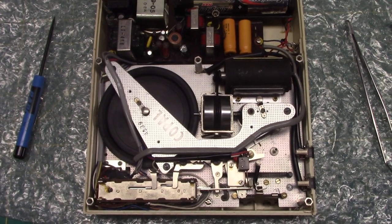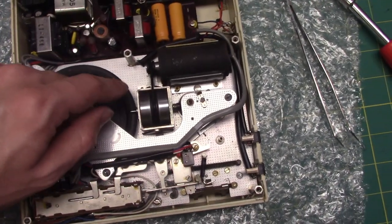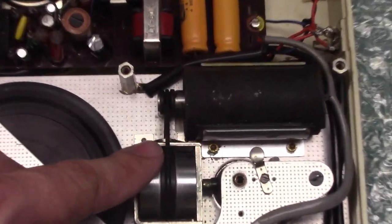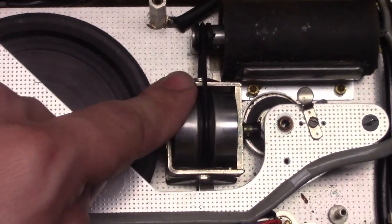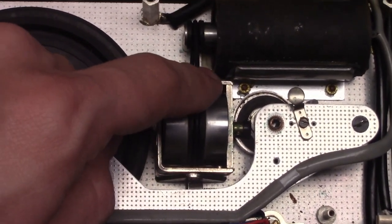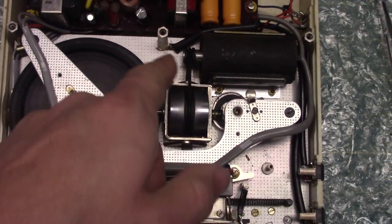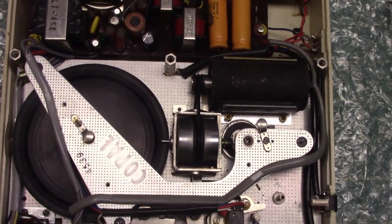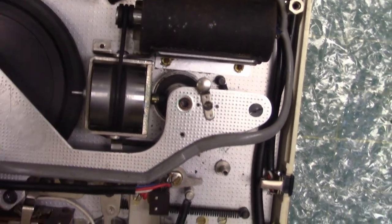Work while the world lives in two different decades at once. I went to Ace Hardware and got a proper belt. Well, really it's an O-ring, but it was a proper size to go in the Unicorder 89. It's round, cross-sectionally, which is what this thing wants, because the square one was flopping about on the round spindles and causing flutter galore.